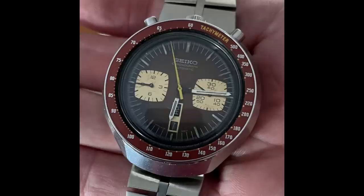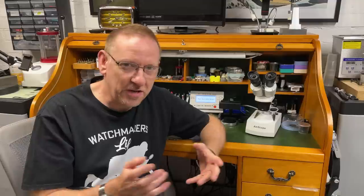And then what also happened was the problem right at the start, if you went back and watched episode 1 of this, and that was that the chronograph would stop in and around 3-4 minutes to 12, but it was completely random. It ran one day for 9 hours continuously before it did it, and I stopped, reset it, and then it stopped again at around, I don't know, an hour, hour and a half. As it's always stopping at the same point, you think, well, that's got to be a wheel, it's got to be a tooth or something.